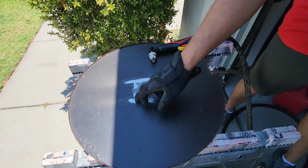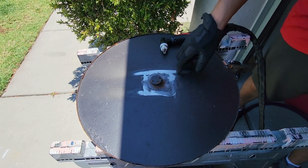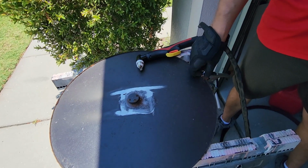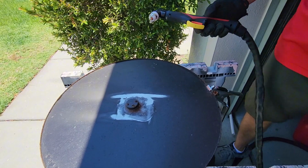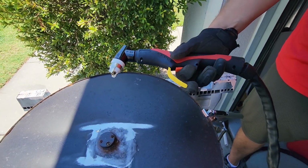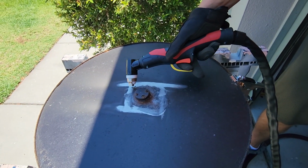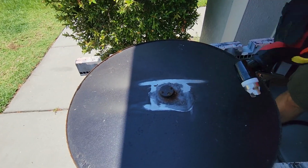And as you can see, we need to cut a square out of here, so we went ahead and cleaned the paint off of there so we can do our cut, and so we can use this lid for our application. All right, very simple process. Once you have it on, you connect it here for your ground. You make sure your settings are correct for the thickness of metal that you're going to cut. It has a safety latch here, so you can't accidentally just press it. So you're going to actually have to lift, and you're going to push down on the red button and put it along here. Basically, your ground and this will make a connection to then cut. As you can see, we already had some test holes there. We're going to be trying to cut all along here. Okay.